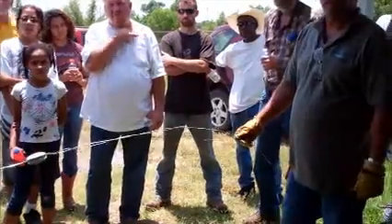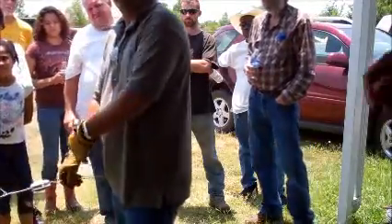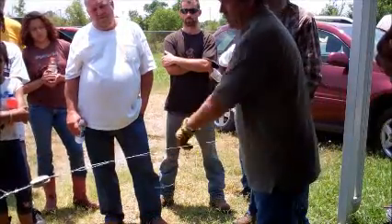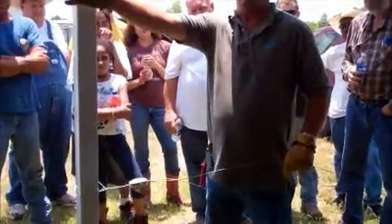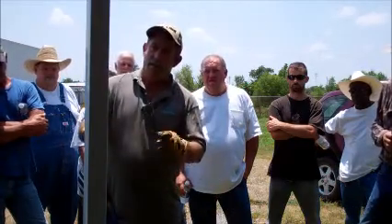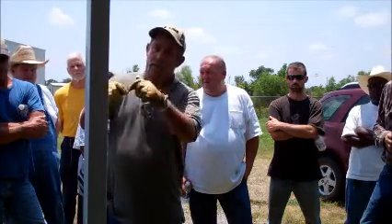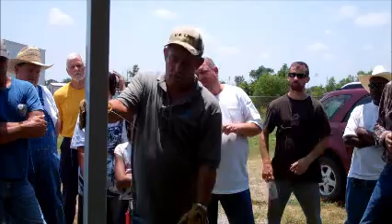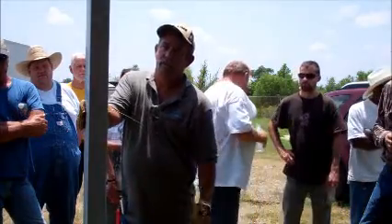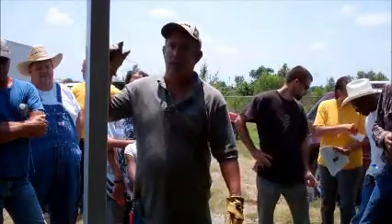You don't need it — and where would you put your cut-off? If this was one of my branches, if I was branching off, this was my main fence line right down through here. So this is going to actually be a cross fence coming off that main wire. I'm going to have a tail on this fence coming through here somewhere. I'm going to put my cut-off right here, put this to the top of my cut-off, come from this main line fence to the bottom of that cut-off. And all I've got to do is turn it on and off and it's hot. That's why you want to leave this — it gives you the option of that cut-off switch, the gate handle, all kinds of different options to work on.